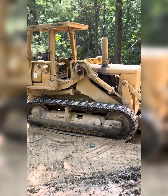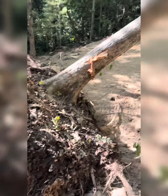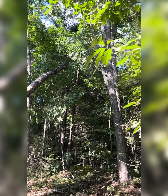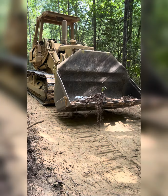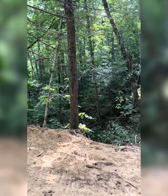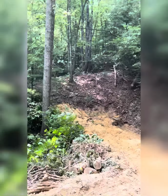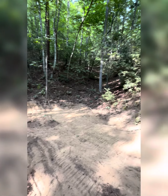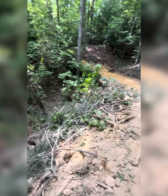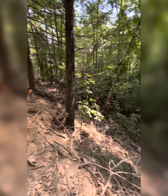Now the track loader is not a bulldozer. It's not meant for grading. It's very difficult to get a smooth finish without what they call washboard or whoops. And you can get it close, but you can come in with that land plane just like you would a wood plane if you happen to be a woodworker, and you can really just smooth it out. Now the nice thing about that is, working in conjunction with the track loader, I'll rough an area in, see how this is roughed in, and then I'll come across it with that land plane and smooth it out. And then as I'm working, I'm tracking that mended area in. The track loader doesn't have a ton of ground pressure, but it does track it in. If I need to go over it again, rinse and repeat.